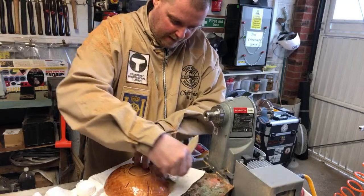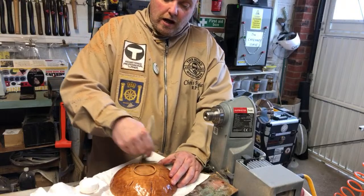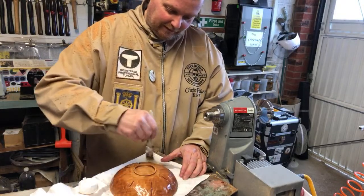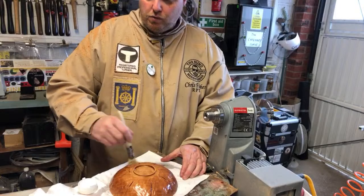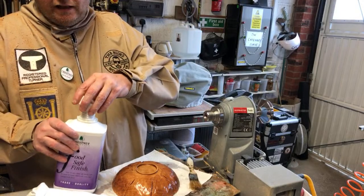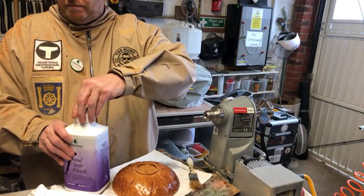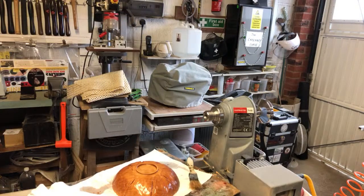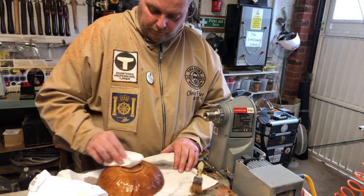Glyn says he's seen some people use Yorkshire grit in their finishing regime. Has he? Ooh, sounds like an interesting product. Do tell more. Dr. D Woodturner, I use Shellac Sealer from Chestnut. Yeah, it's just what you're used to, you're happy with. Me being a stickler for routine and process, cellulose sanding sealer and friction polish work really well for me. Obviously, in between that is a good dollop of a certain abrasive paste, we all know. Both types.